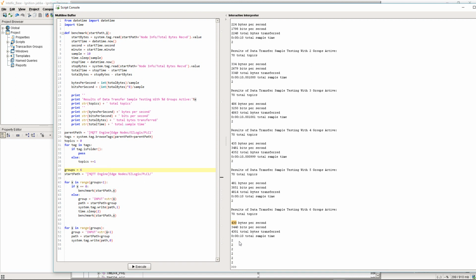So there are two more tests I have to run. The next test is pure OPC UA with no MQTT, and then the last test after that will be to run the MQTT benchmarking with Sparkplug B from the PLC over a cellular network, which I do have a cellular gateway for. We'll be testing that into the cloud, and I'll be publishing those results as well.